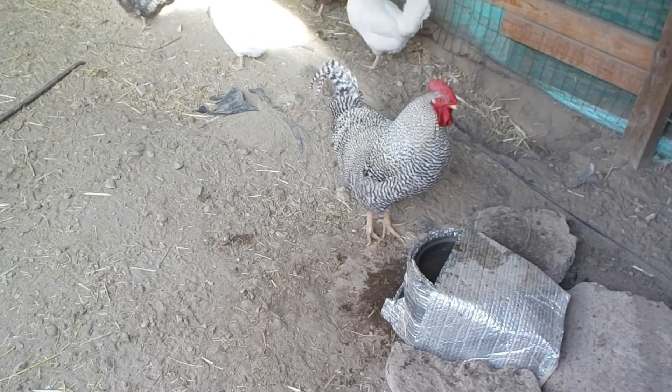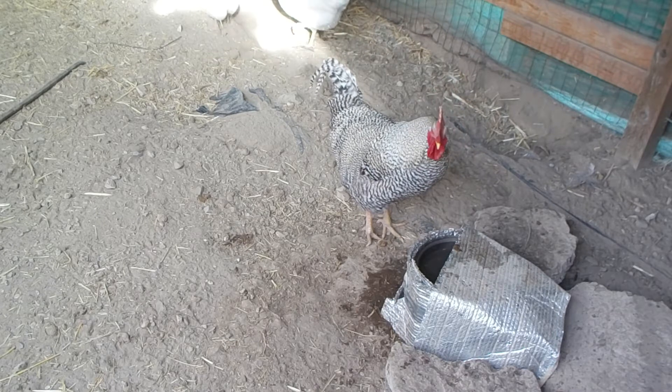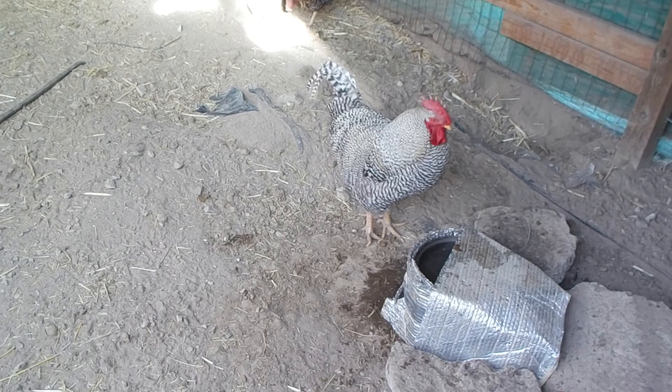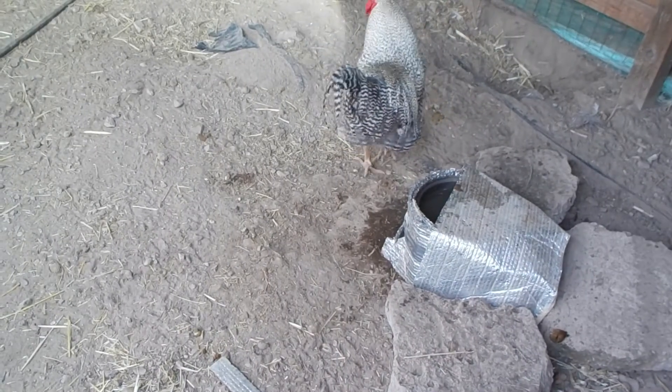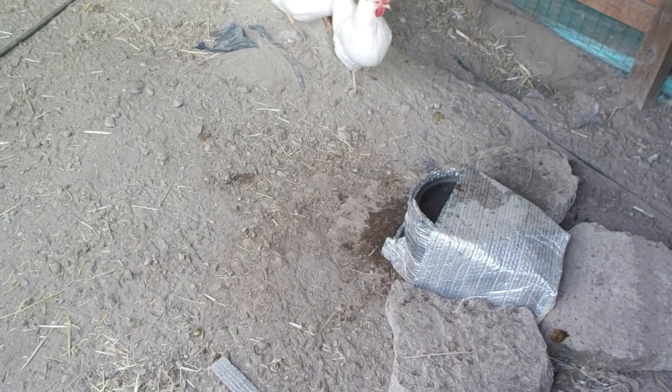This is what I worked out to keep the water liquid for the ducks and chickens while I was away, and it seemed to work really well. I went to Cal Ranch and IFA to find something to keep the water thawed out in the winter, but what they had wasn't suitable for an off-grid arrangement. It was rated at 100 watts and needed 110 volts, which I have with my inverter, but if the batteries run down, the inverter clicks out and doesn't restart.